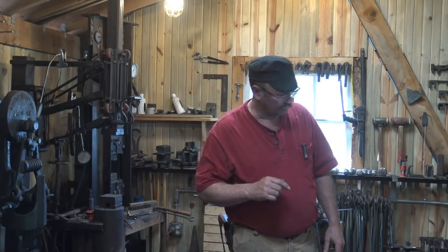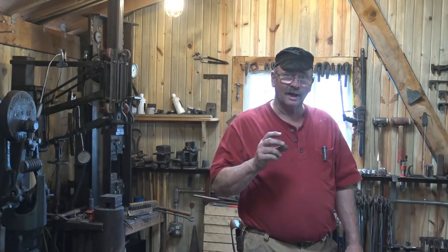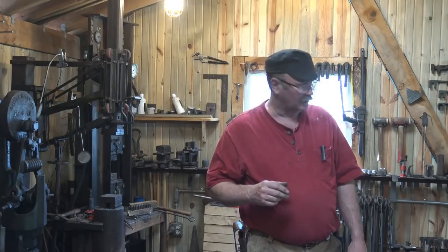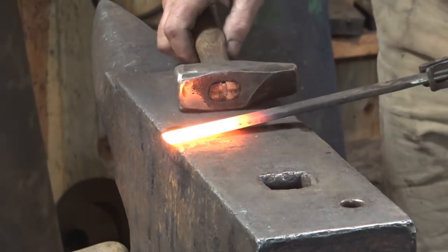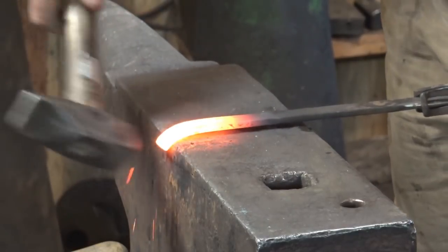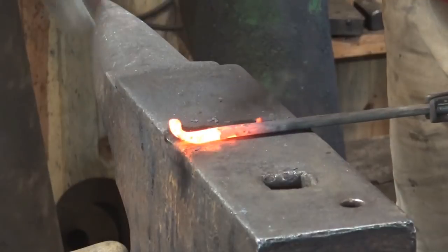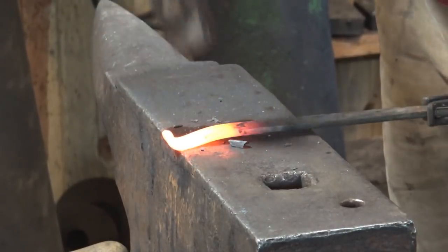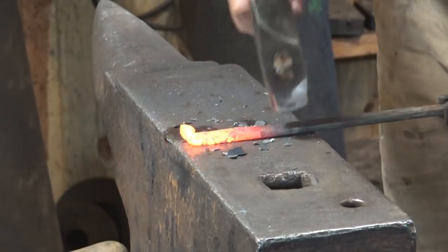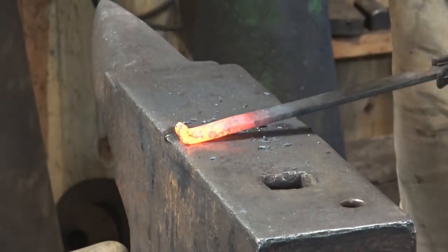The first one we're going to do is really quite simple. I'm just going to bend the end over a little bit, upset it ever so slightly, taper back, and that will become the snub. So I'm just going to bend this over a little bit — just the end. What we want is kind of a round end in the long run, so I just want to do a little bit of an upset here, and sort of vaguely a square corner, trying to keep everything even.